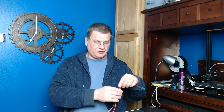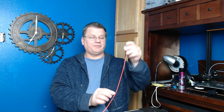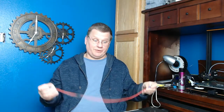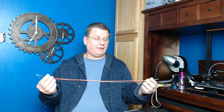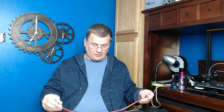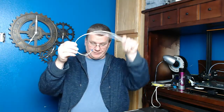In my kit to make your Anet safer, I also include a new power cable made of silicone — this is 14 gauge silicone. The one that comes with the machine just simply melted when I touched it with a soldering iron, instantly. It's pretty low grade stuff. I've also included a second set of these to hook up the MOSFET board if you're installing one, plus the extra plug you need. So with my kit you get the harness plus two sets of power wires.